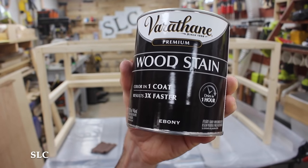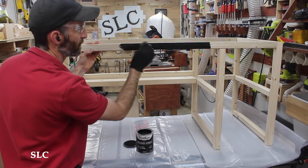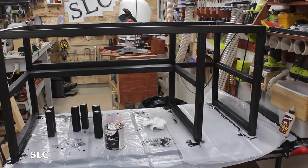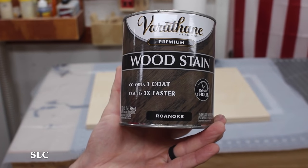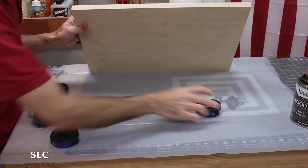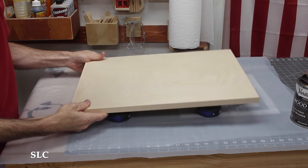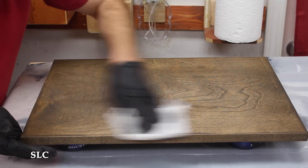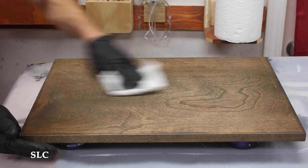For the frame of the desk, my son wanted a dark ebony stain so that the wood would look more solid and almost metal-like. After a nice coat of ebony, the grain structure of the wood was still slightly visible but very dark. For the desktop and the shelves, my son wanted a lighter color called Roanoke. This is a great time to use some bench cookies to lift your piece off the table to make it easier to get around the edges. After staining each piece, I went back over it with a paper towel to remove any excess, which helped the wood grain really pop.